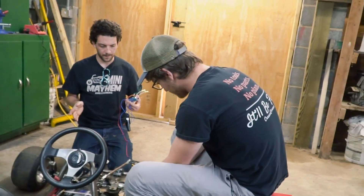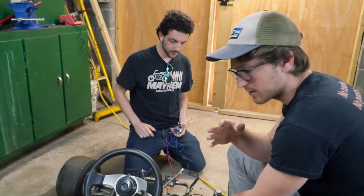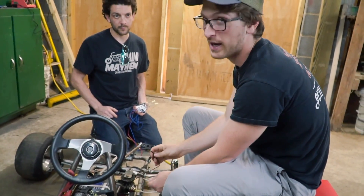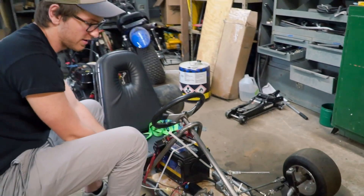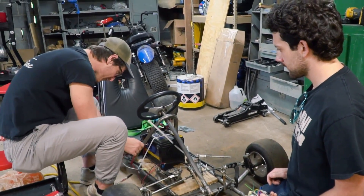So we just made the steering arm a little bit longer so that while we'll have less degrees of travel, we'll hopefully actually be able to turn the wheel. Before we had some trouble getting from the right back to the left — it would really only want to steer in one half. We hope to get a little more power by making the arm longer. Let's see if it'll turn.